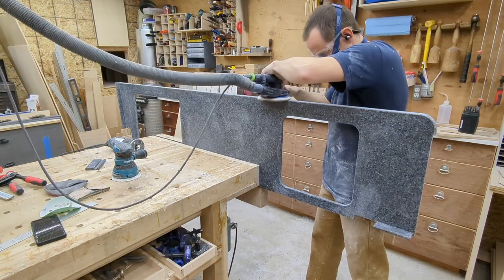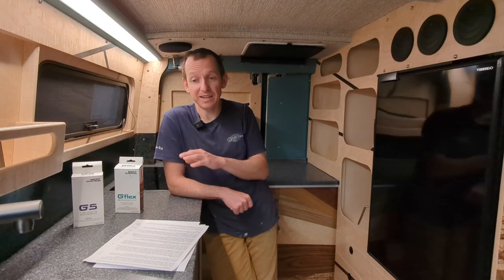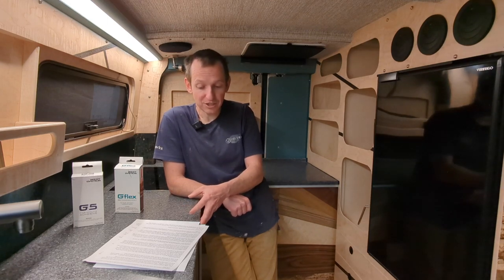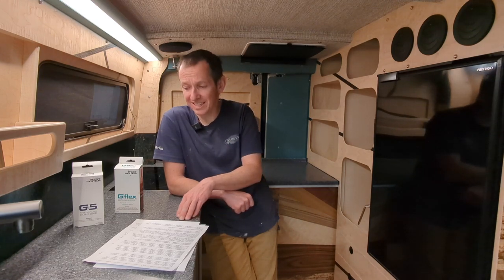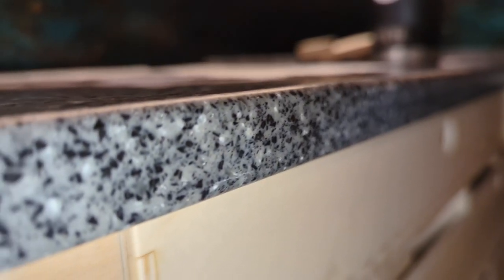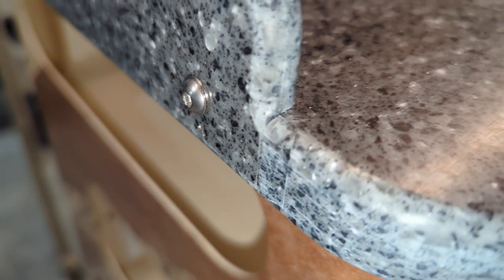And that is a really important factor. All this countertop stuff, you do have to sand through a pretty high grit, but it is really easy to get a nice finished surface by just sanding solid surface. On these front edges here, I think if I did sand to like a 2000 grit or whatever they recommend in the manual, I could get it to look identical to the actual surface of this thing. But I find that if the surface is a little duller along the front edge here, I don't think it really makes a difference because you're kind of looking at two planes, so they're never sharing the same exact light look.